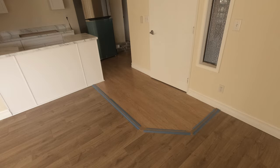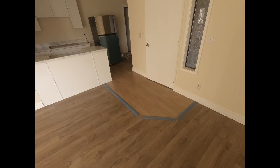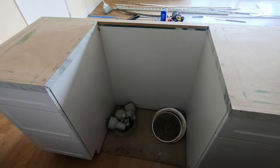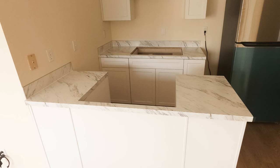First, I'd like to take a minute to talk about this new flooring. They ripped out the old carpet and installed laminate flooring. This original entryway leading to the kitchen was a great idea when the rest of the room was carpet, but it is false economy to leave it there now — it would be so much better to cut it off at the entrance to the kitchen. The finished end of this countertop is nearly flush with the end of the cabinet to prevent a big gap between the refrigerator and the cabinet. Usually we only want about a quarter inch overhang next to freestanding appliances. A freestanding range is scheduled to go here, so the inside edges of the opening get laminate. After fitting the deck to the wall, the edge of the laminate only needed a little filing without having to trim it. I often press the tip of my utility knife into sheetrock to hold laminate in place.